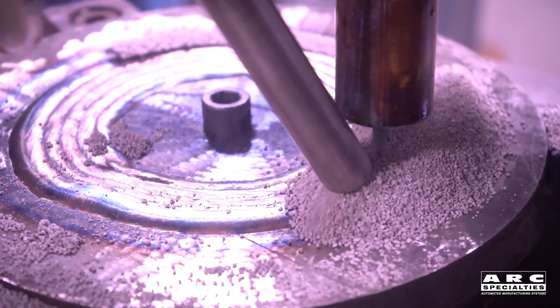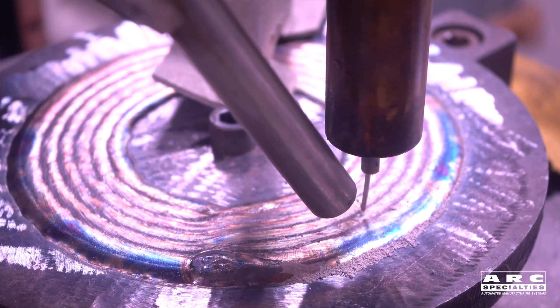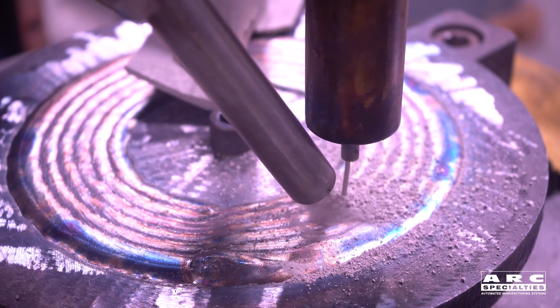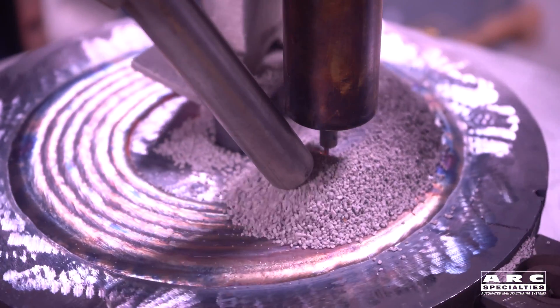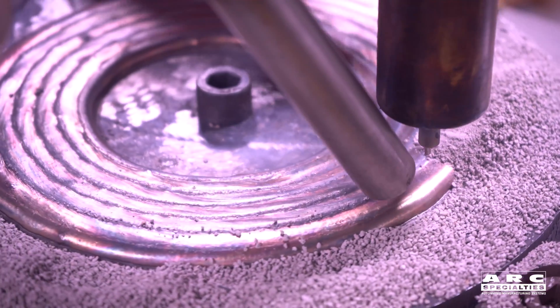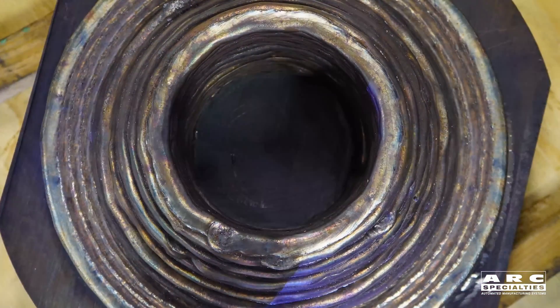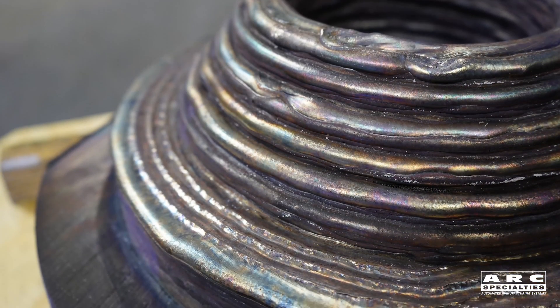What you're seeing here is we're doing additive manufacturing with submerged arc welding. This is an ancient process — it's over a hundred years old. A lot of the young engineers consider it to be out of date. Not me. I think it's a wonderful process. You can deposit huge volumes of metal; I've done as much as 60 pounds per hour. In this case, we're running at 15 pounds an hour — many times faster than gas metal arc welding.